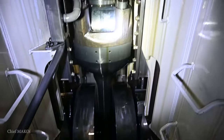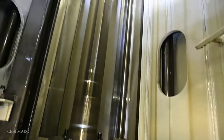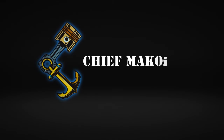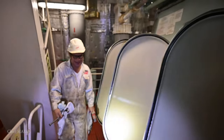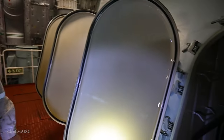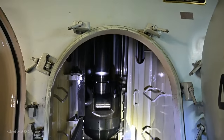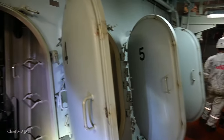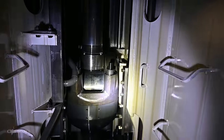Now, to give even more perspective, let's have a look inside the engine's crankcase. In this episode, the engineers will be carrying out the crank web deflection readings. This is something that is done regularly in order to detect any misalignment of the engine's crankshaft.